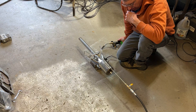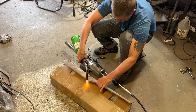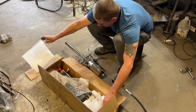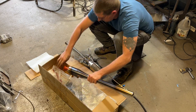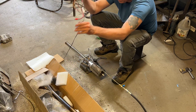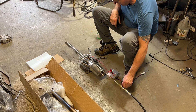Last time I had a completely different valve and I have a feeling that's affecting the operation. So I changed the valve and tried it a bunch of times — I spared you that boring footage. I'm now busting out an actual machined pulsejet engine that was sent to me by a company to try out. They have an igniter box with it, so we're going to try firing a spark plug on this thing — but it did not work at all. It's a very weak spark.